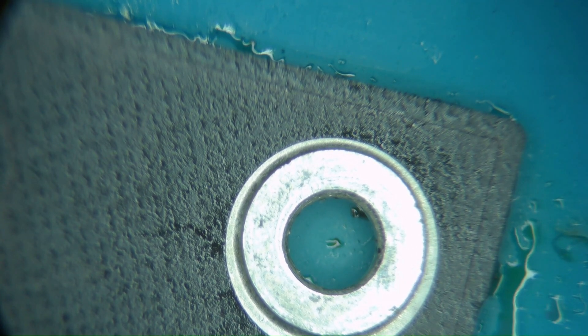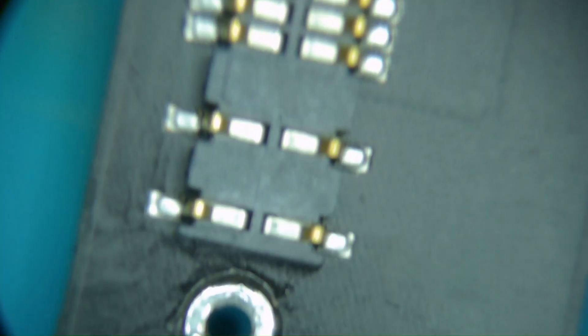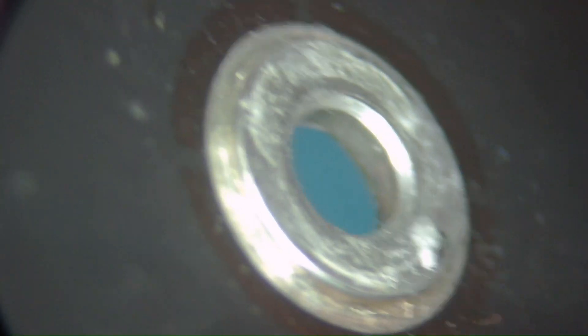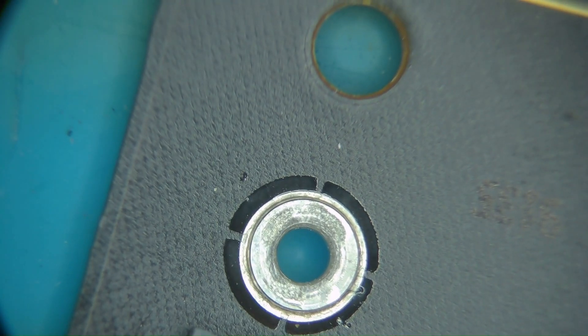We pushed down on it while we were heating it — it didn't just go through a solder flow oven with some solder paste under it. Let's see where the other ones are. That one was the first one I did. These are kind of important too. That one was missing and this is the battery connector, so this has to keep pressure on the battery. That one's cracking too. This one was hard — this one did not want to take heat. I might have to preheat the board with hot air here like I did on the other one.